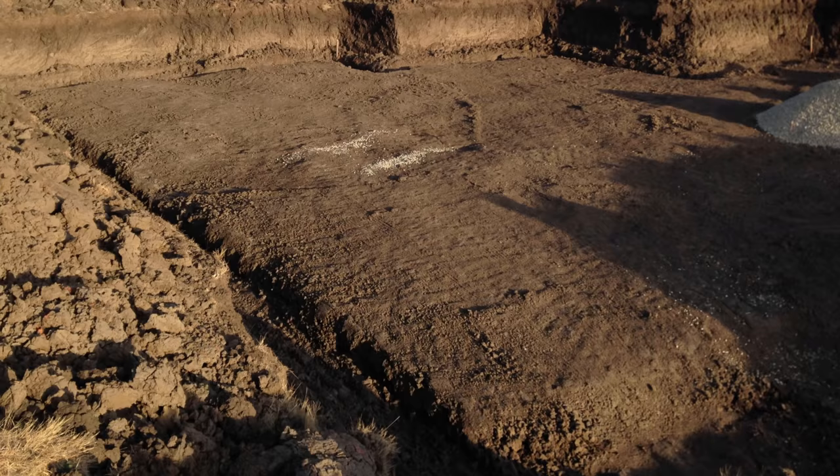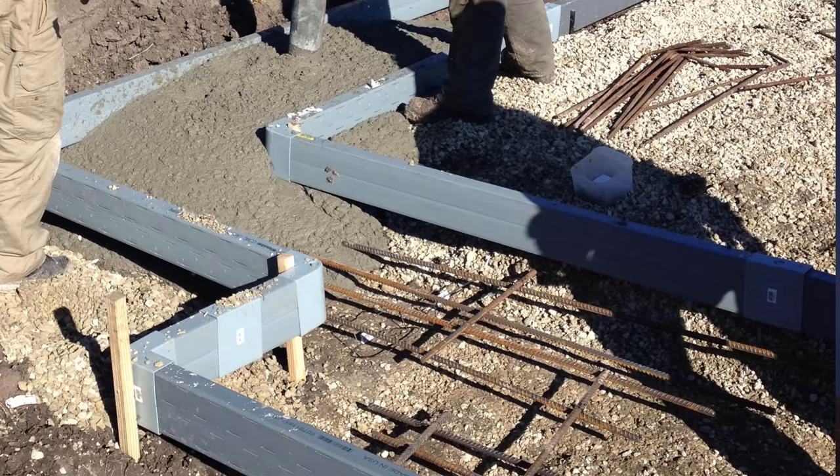The whole process actually starts when you are excavating for your basement. You're going to over-dig a little bit and then dig out for your footings. You want the top of your footing to be at least six inches higher than the dirt floor of your basement, because you're going to fill that whole area with drainable rock. In my case I used three-quarter inch crushed stone, which is a great drainable rock.